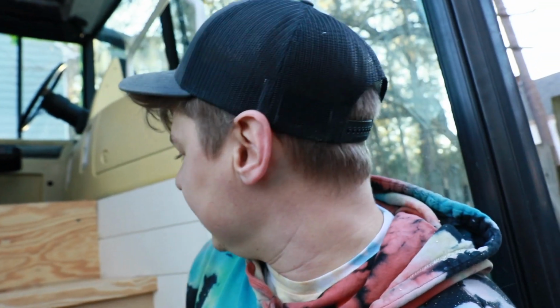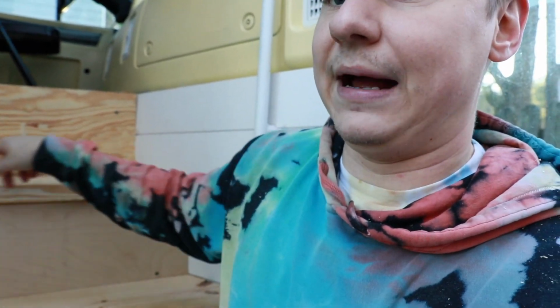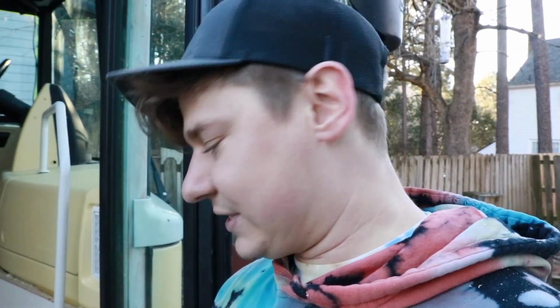The issue that I did, and if anybody else is copying this, this might save you making the same mistake, is on this corner piece, because it's at an angle, I measured the front and the back of the step and then cut it to that angle. However, the mistake that I made is I was forgetting about this little lip, and so it created a little gap here. So I ended up using this tool instead of measuring, which is a real nice tool to have. You can just adjust the angle for the step, and once I started using that, it was a whole lot better. I should have probably gone with that to start with. Originally I was like, I can just measure the size, and, well, you know what happened. So, got these 2 done, and now I've got to go get material for the final one, but pretty happy how it's looking, guys. Let me know what you think.